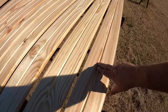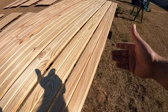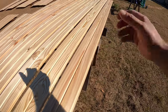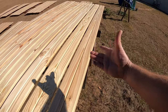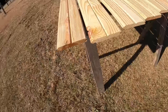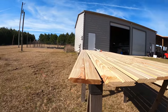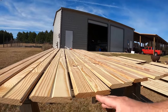You'll notice this looks like double V-groove pine, whereas when you flip it over it does not have the center groove. This company offers single V-groove, which is the big flat side, and double V-groove. I'm wondering if they cut one board the same and you can sell it as either — you just pick a side. I don't like the extra V side; it's too busy and looks too much like beadboard, which doesn't fit our home's style. Another theory is they might be cutting that V to prevent cupping by taking some of the tension out of the board — without the V, the board wants to cup back toward the way the rings are.